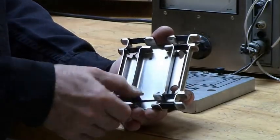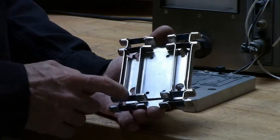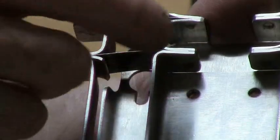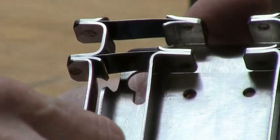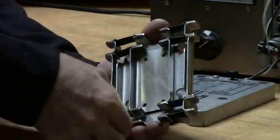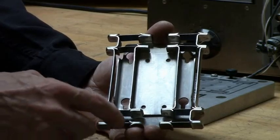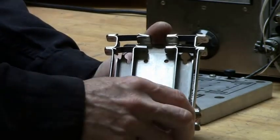A couple of tricks: nitinol cannot be spot welded, so you trap each piece between two little pieces of stainless steel. You bend the edges around in order not to have a sharp transition — that's very important because a sharp transition is a stress concentration problem. You very carefully measure to make those equal. The best way is to use a jig — a piece of metal acting as a spacer — so when you weld, you insert the spacer, weld, and then remove it, so the spacing is the same everywhere. How straight a line it will travel depends on exactly matching those eight springs, both in length and stiffness. Stiffness is no problem since they're all from one strip, but lengths have to be quite nicely matched.